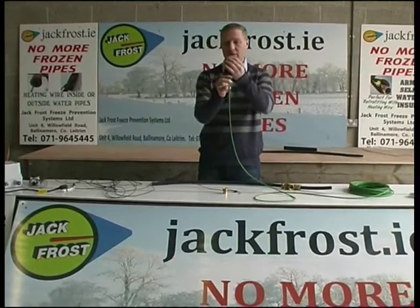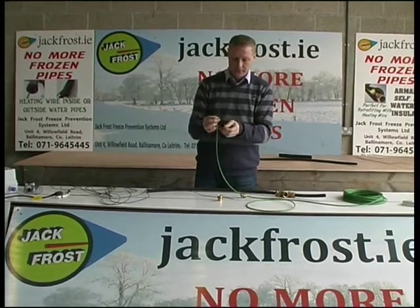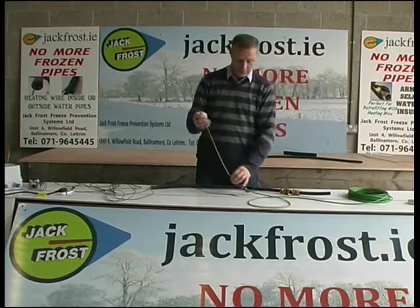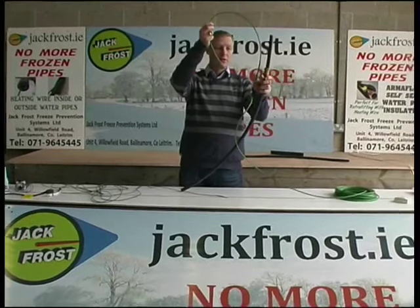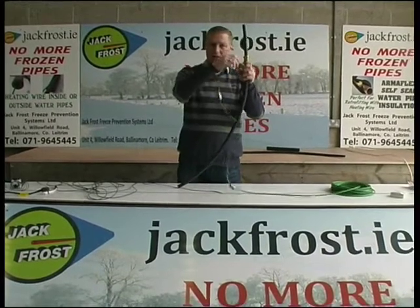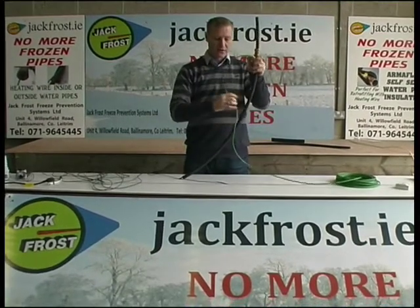The wire goes through each of those components. First, this collar here — just squeeze it in. Then a washer. Then the little rubber seal fits around it — it has a little split in it because sometimes it can be hard to push up, so you split it and put it around the wire. Then you put it through here. We can imagine this is under your sink — you insert the wire right in and all the way down through the pipe, right the way through, underneath your garden, underneath your concrete, underneath your footpath, out as far as the mains connection to the road.